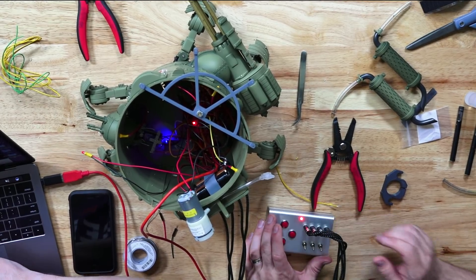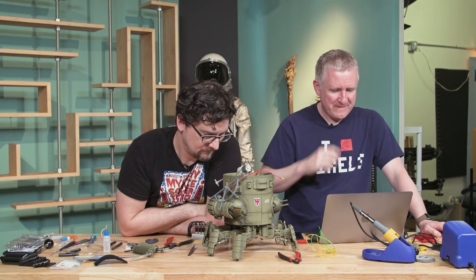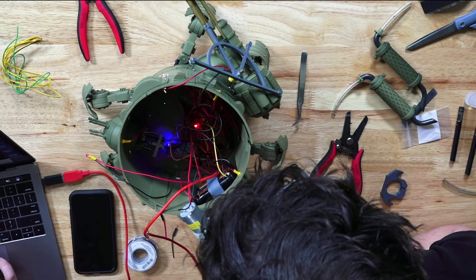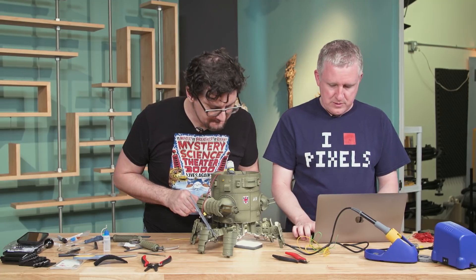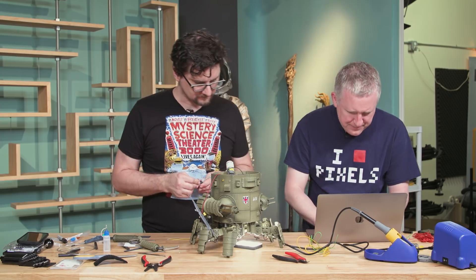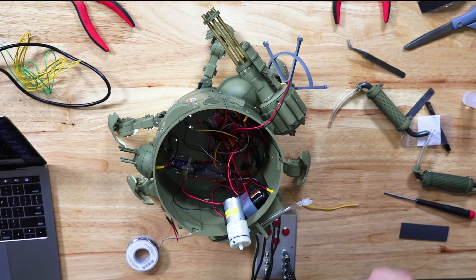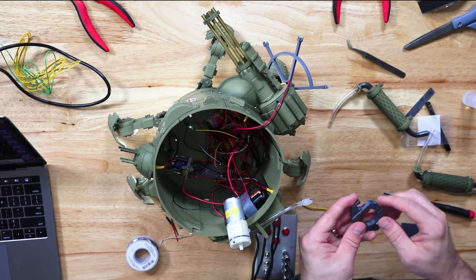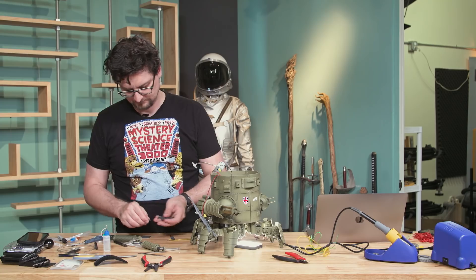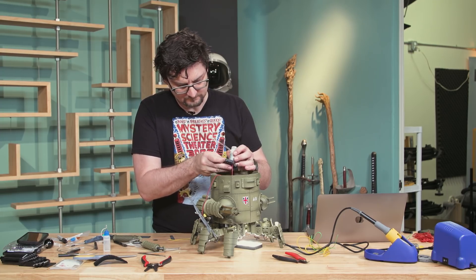Let's watch these lights to see if it flashes. With these cool red Funduino boards, I found they only flash after a reboot — you have to unplug and plug them back in — unlike regular Arduino boards which can reset on their own. That took about ten minutes to figure out. I was modifying the existing open-sourced code: wherever it started to walk, I send the smoke signal, and wherever it stopped walking, the smoke stops. It's just a matter of setting that pin high — any Arduino programmer should handle that easily.